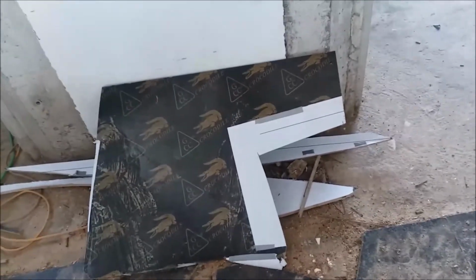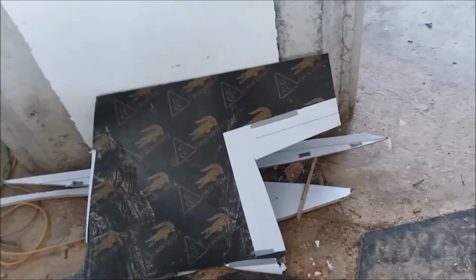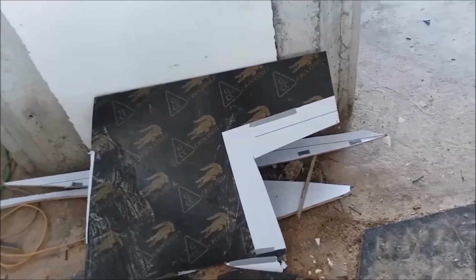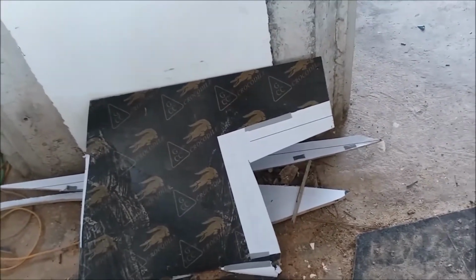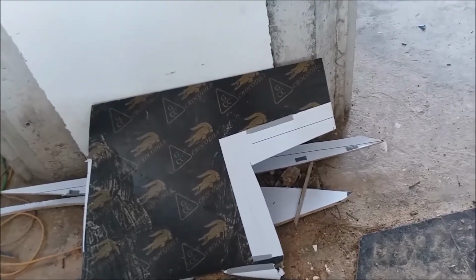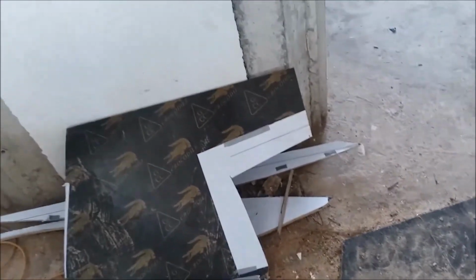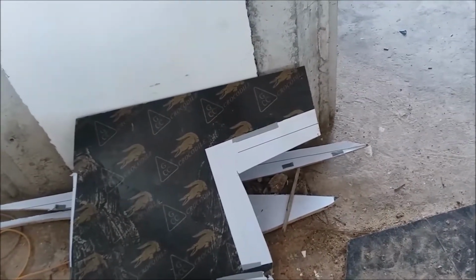I work at tolerances of 1/8 of an inch back in the States, but it's tedious to try to get that much out of a sheet. But if you're cutting up 35 sheets for an aircraft fuselage, for a compound curved fuselage, one sheet starts to look like money. Because I use 11-layer birch plywood there.